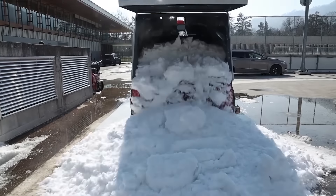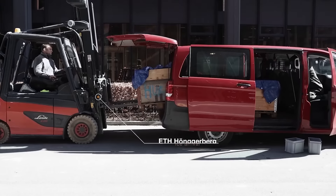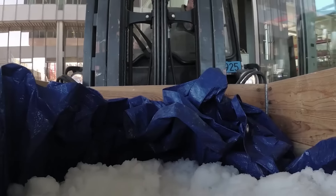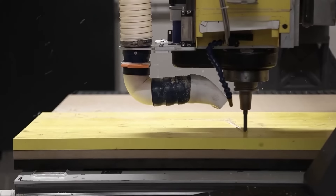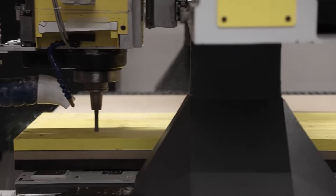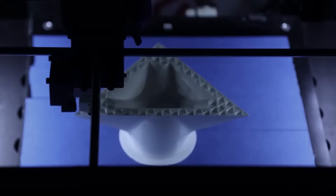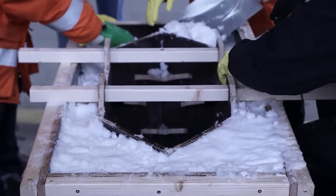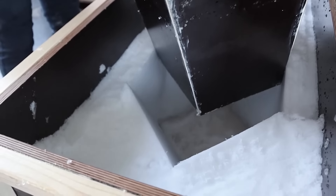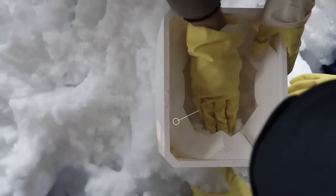This cold production project was created by students of the Master in Advanced Studies in Architecture and Digital Fabrication at Zurich. Ice units were formed using 3D-printed molds in the subzero lab at minus 10 degrees Celsius, enabling rapid and waste-free production. Concrete was poured into these molds, cured and then placed outdoors for demolding as the ice melted away, revealing intricate lattice designs.